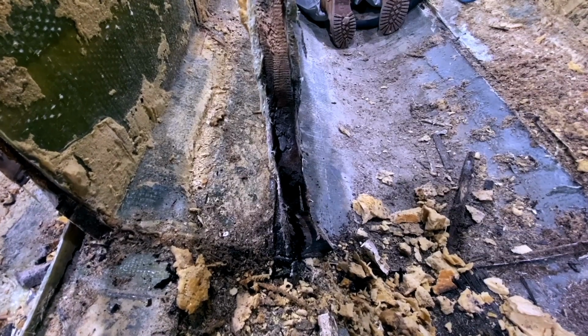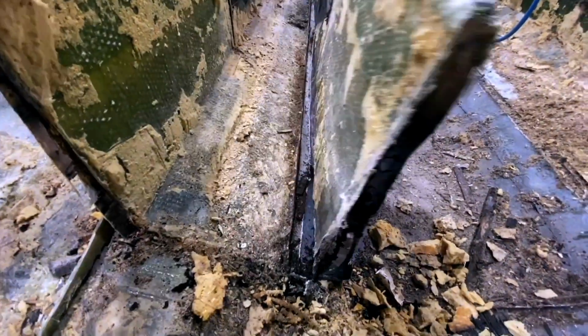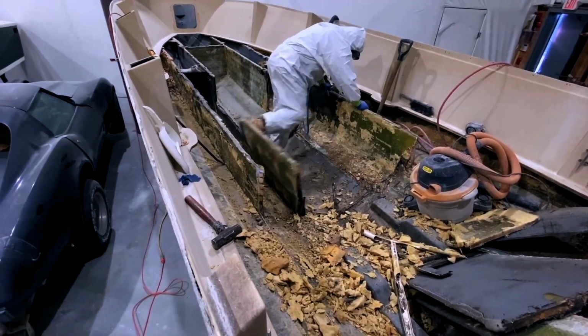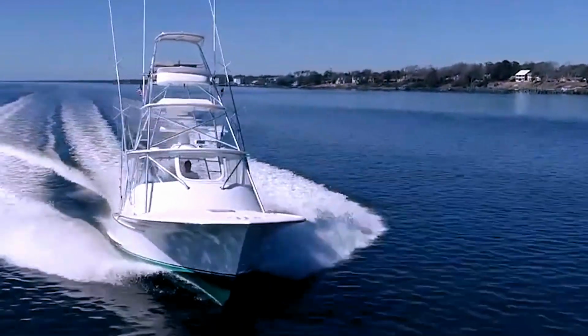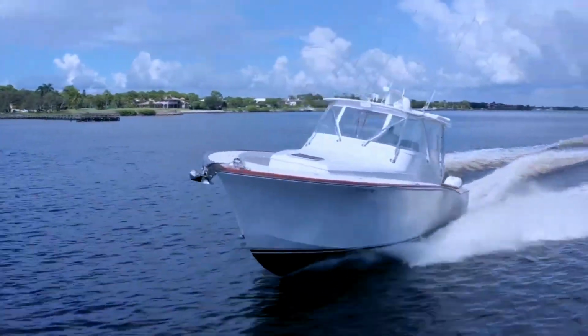We have always been big fans of epoxy resin in combination with using organic materials such as wood. Wood has never worked well using fast-curing polyester or vinyl ester resins. Why boat manufacturers continue to use it is beyond me. However, the higher-end boat builders, both production and custom, very rarely use either polyester or vinyl ester resin in combination with wood. Some of the most badass custom Carolinas and Florida Palm Beach bad boys are constructed out of plywood laminated in epoxy. And these boats will be here long after we're gone.